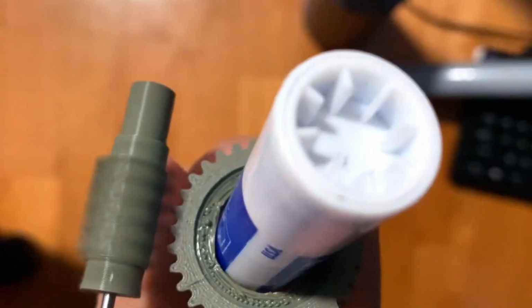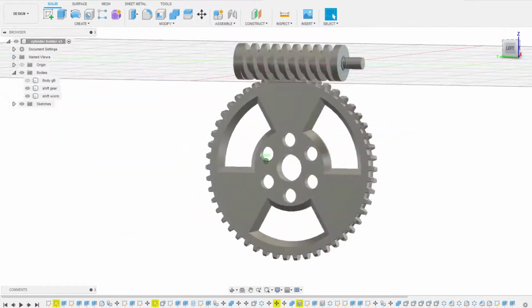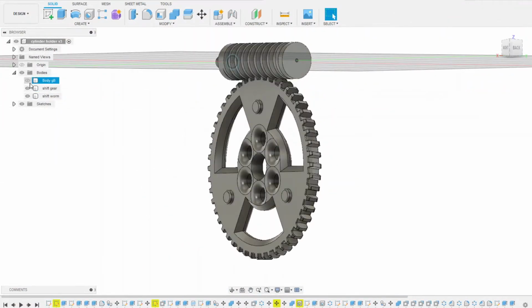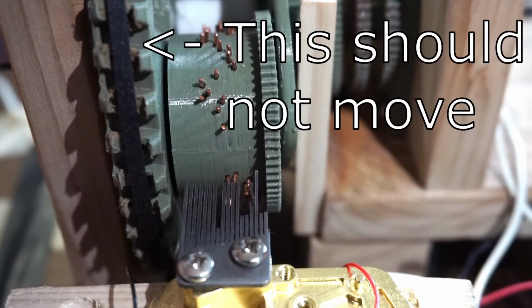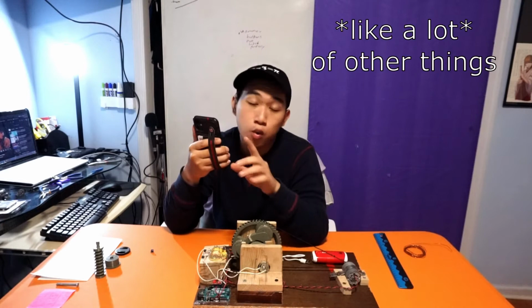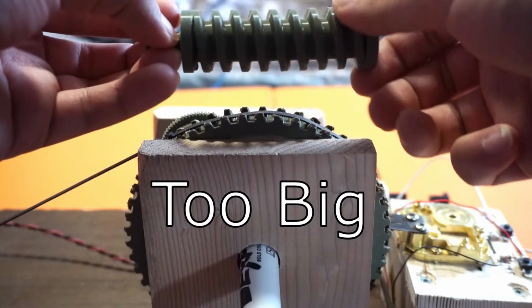Originally, I designed the shifting ability with a worm gear in mind. That way, while it's not rotating, I can make the structure stiff at a pre-programmed location, since the barrels will cause some kind of torque once they strike the pins. This did not work out, however, since I do not have any motors strong enough to drive the worm gear.